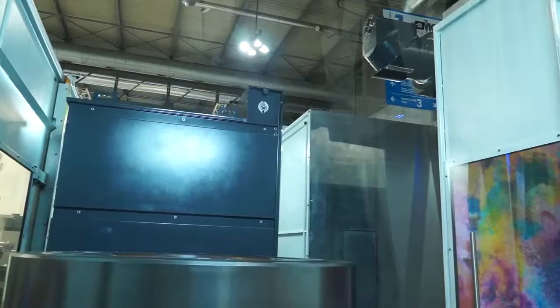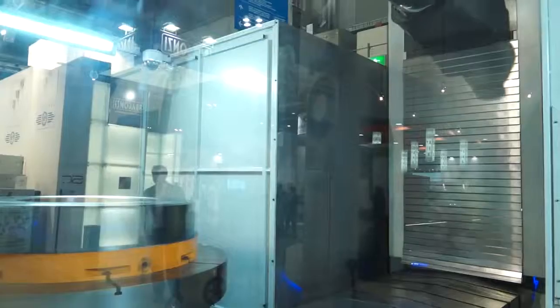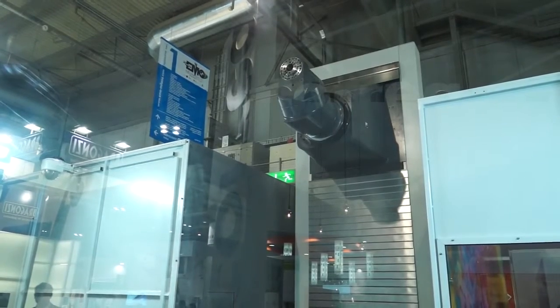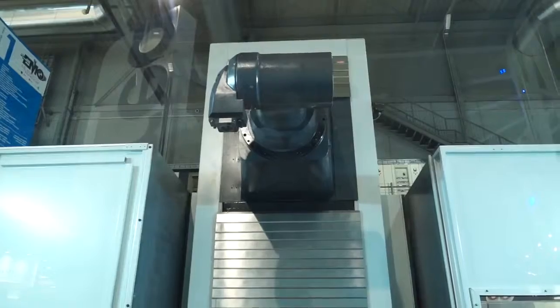And on the milling side, let's just touch on that. What are the capabilities on the milling? What sort of speeds, power have you got with this as a milling machine? Well, as a main part of our product strategy and how we try to make our machines different from the competitors is the robustness of the structure. So from the milling point of view, in this machine, when we take the milling head, on the spindle, we can have up to 52 kilowatts on the spindle in S1, I mean, in continuous working, and a torque of 1,375 Newton meter. So if you compare this size of machine with others, you will see that these values are really high, considering that these values are inside a mechanical two-axis head.